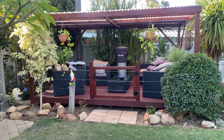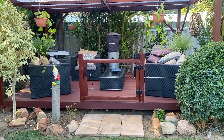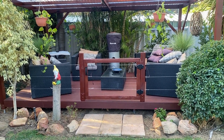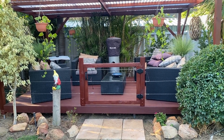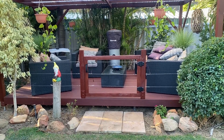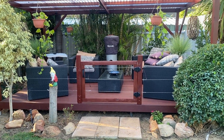I've done all that and as you can see it's come up pretty well. Then another idea occurred to me — I could actually turn that wire into an antenna, and that's exactly what I've done. I've been amazed at the results. Whether it works well being so low to the ground I don't know, but I know it'll be a great receiving antenna. I've turned it into an off-center fed dipole — a bit of mucking around, but I'll go through what I did.